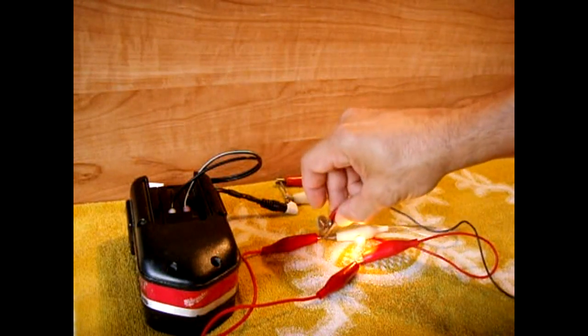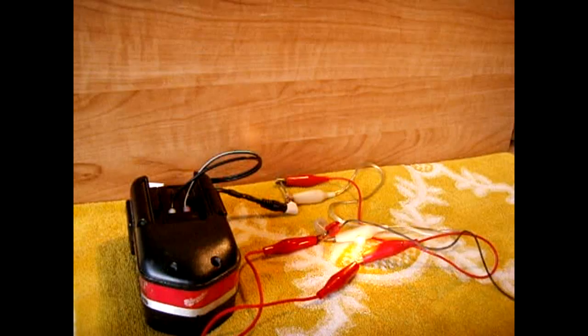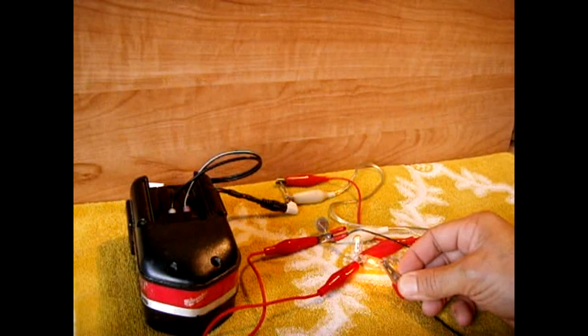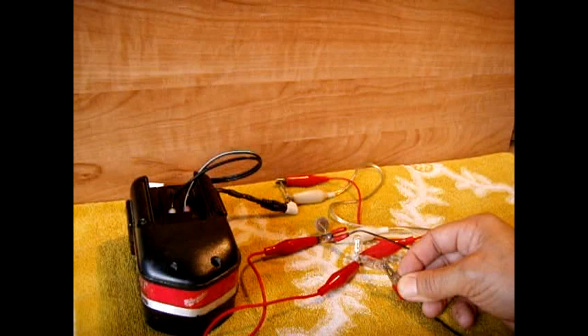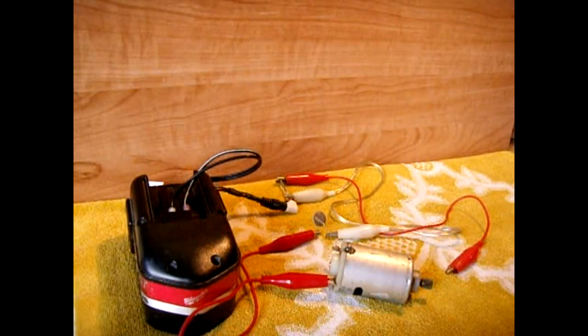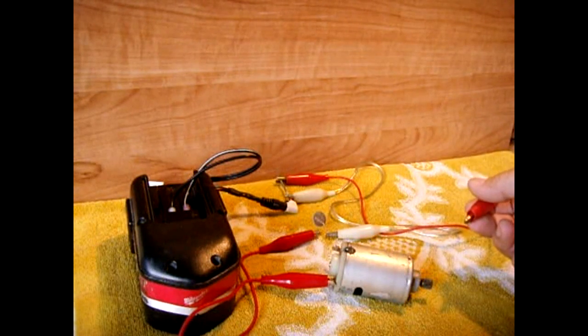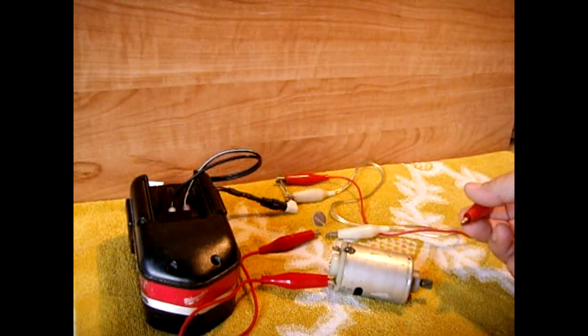You can see it's running steady. As soon as I add an extra load — the one-amp bulb — you can see what happens: the circuit shuts down. It exceeded the current rating, the thermistor is going to be fairly hot, and everything powers off. It acts just like a circuit breaker and it automatically resets — you just have to let it cool off. With the PTC in place, I'm going to connect the motor. It will come on fast, but because the motor draws more current than the rating of the PTC, it will slow down and shut off.